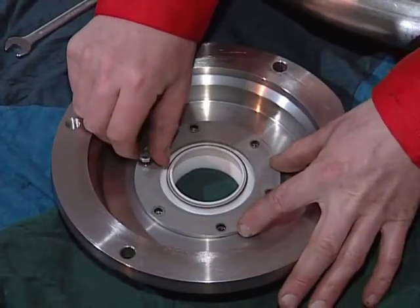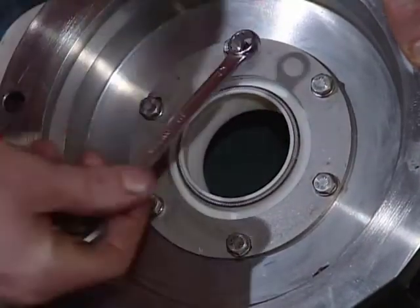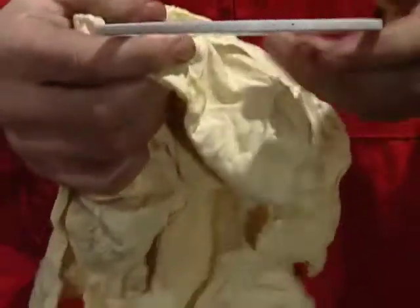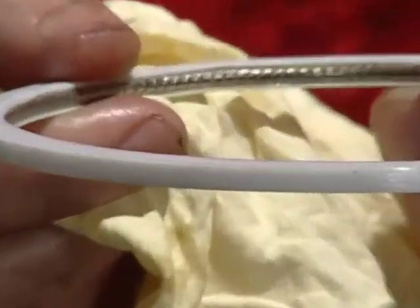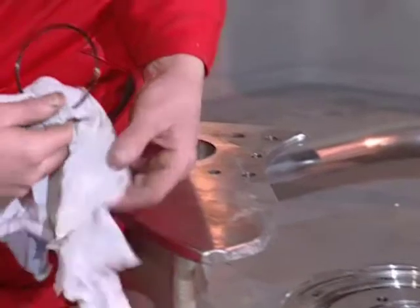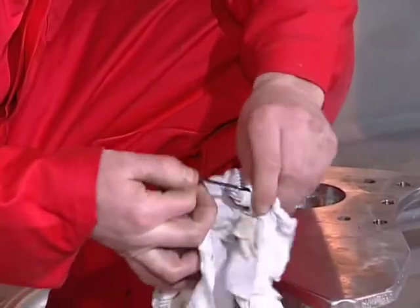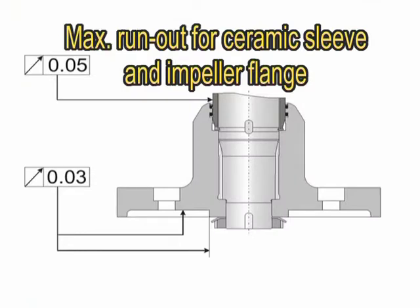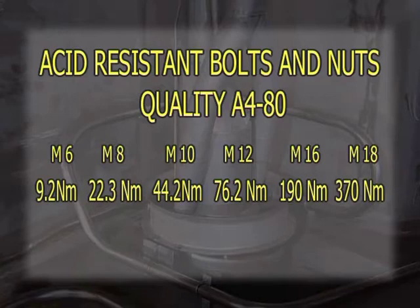Make sure that the support ring is tightened up to metal contact to avoid screws loosening. Check all seal elements, seal grooves and seal faces carefully. Pay special attention to the Teflon rings and be absolutely sure of no deformation. Never install a damaged O-ring and be sure to check for corrosion, cracks, dirt, etc. Remember, use only genuine spare parts. If any abnormal lifetime on the cargo seal has been experienced, check the run out on the ceramic sleeve after assembly of the impeller flange. All screws and nuts have to be assembled with specified torque.